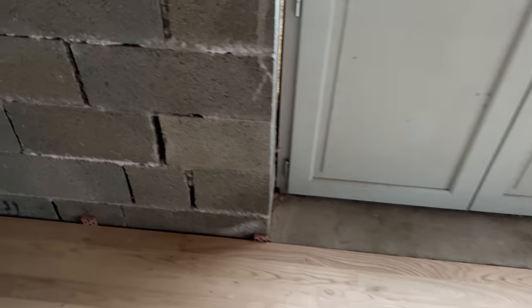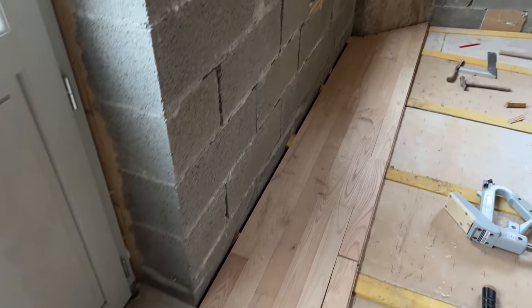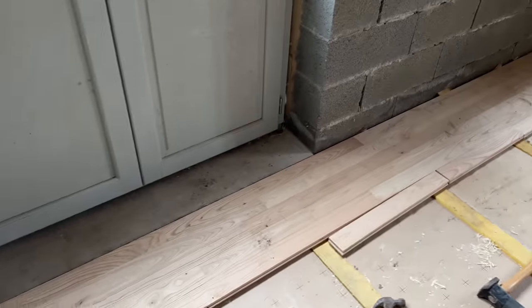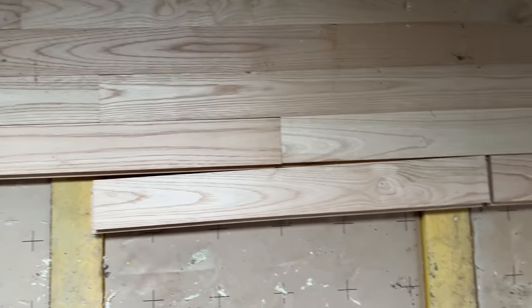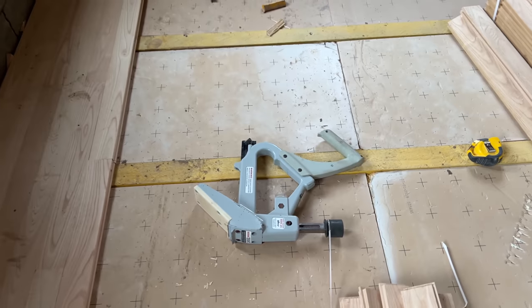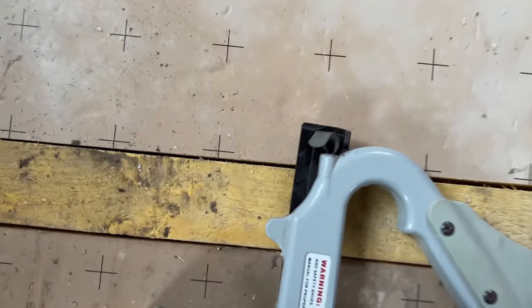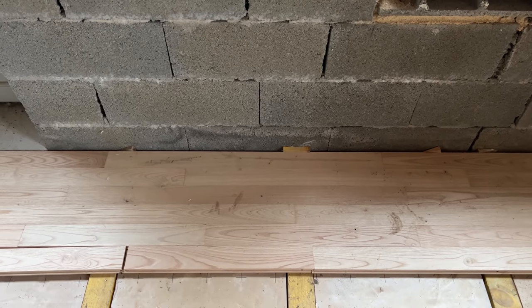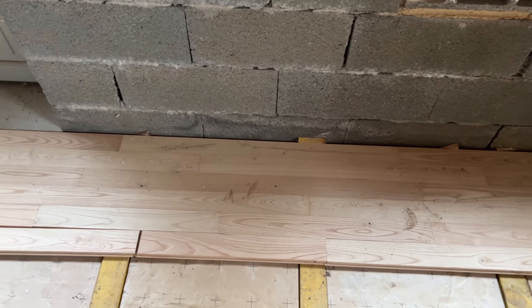I've just set it all up and now I'm going to show you how I lay the parquet. To get it level I've put little wedges in and pinned those first ones down. You have to offset the joints as much as possible so you don't have two joints in the same place. It's been a bit awkward at the start because this machine here normally has this plastic bit sticking quite far out at the back, but because we've been working next to the wall it's been a bit difficult — a bit slow and tedious.